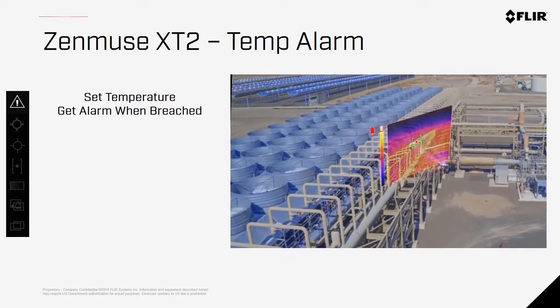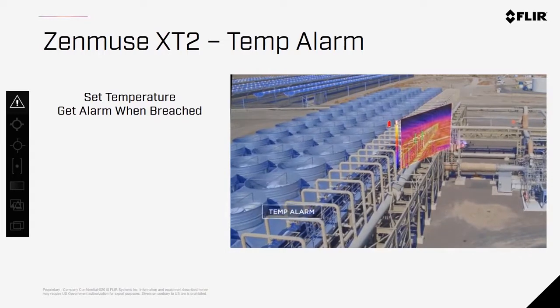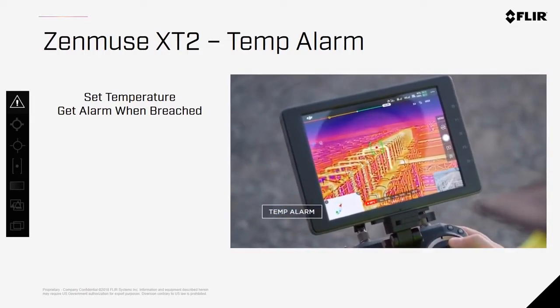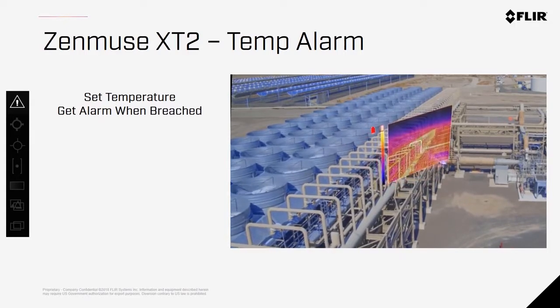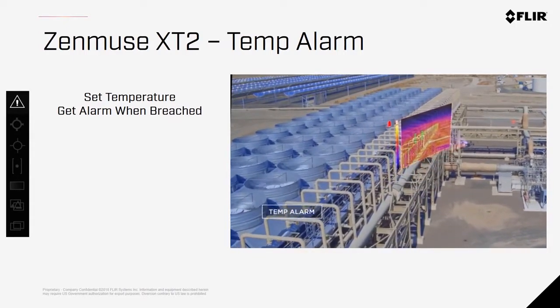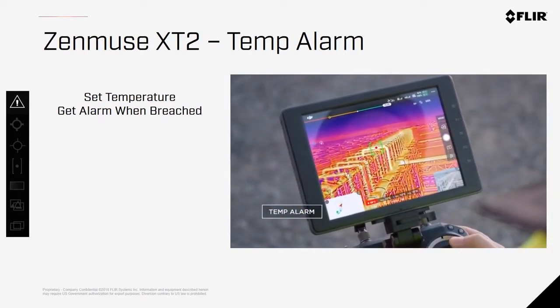Temp Alarm allows you to set a threshold temperature, and as the camera is flown around, anytime that something goes above that temperature threshold, an alarm will sound. This can be useful for a variety of inspections, as well as some search and rescue cases.